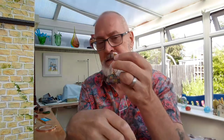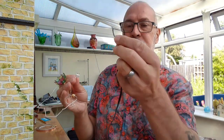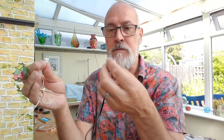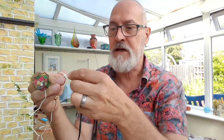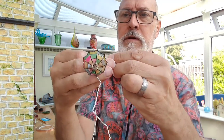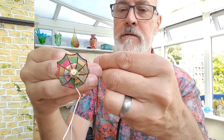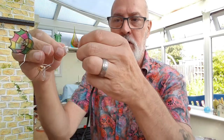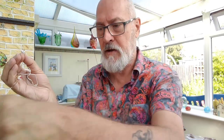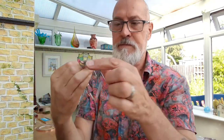First of all, when you buy lights and you take them out of the pack, test them first to make sure they work. So this is plugged into the mains now, but it's a transformer, so it's just a 12 volt battery. If I touch both of the wires onto there, hopefully you'll see that the light does come on. It's hard to hold it with the camera and everything, but that light works, so that's fine. So we can lay that down safely. So make sure they work.